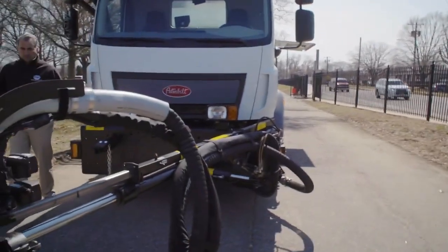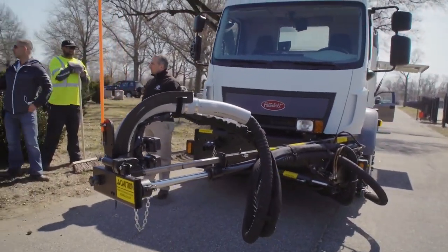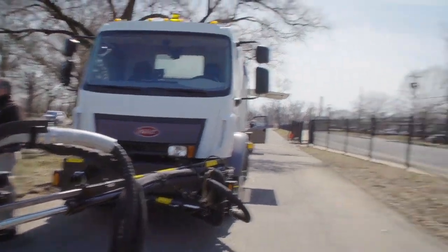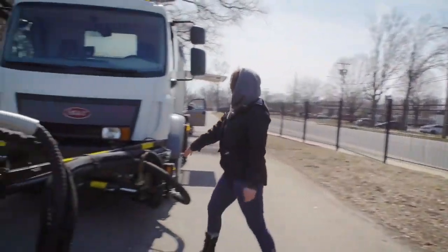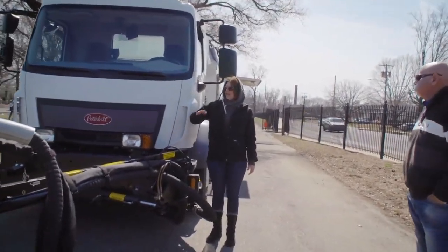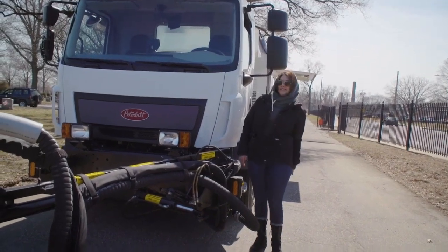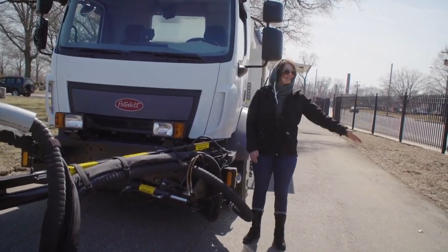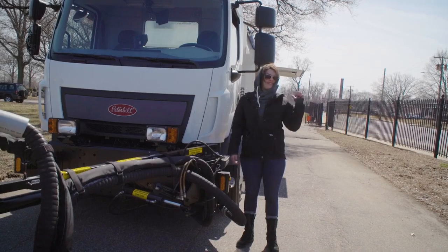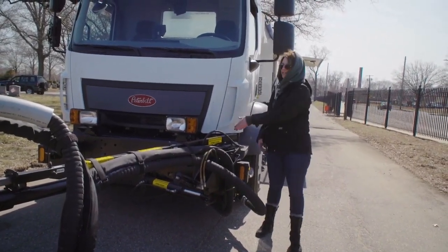The boom is not fully extended — you probably have another couple of feet of reach out to where he's standing. What's nice is that it's now pinned to the left rather than in the middle, so you have much more reach. Being pinned on the left, you can truly get that skip stripe — you're not in traffic, you can go over a little bit more and still see traffic and patch safely.